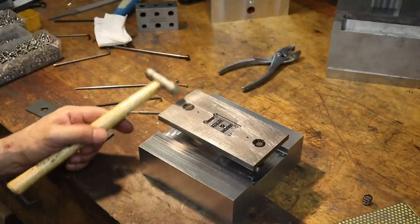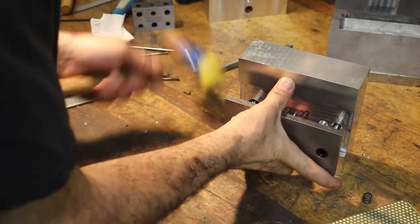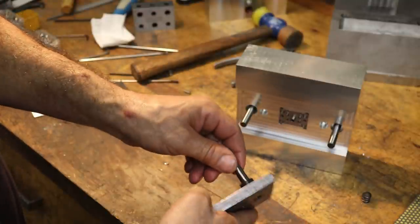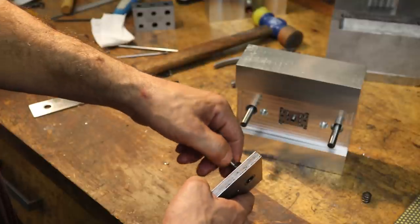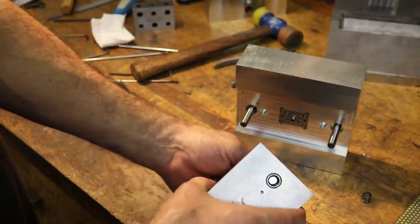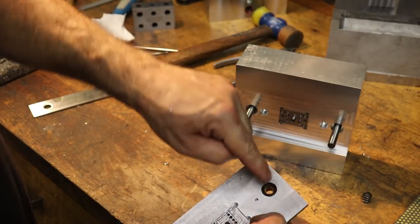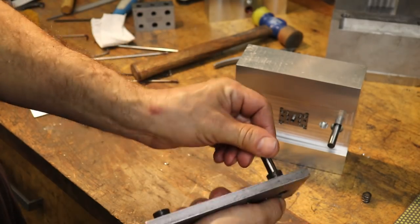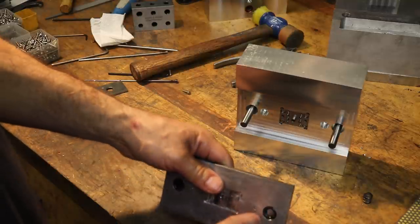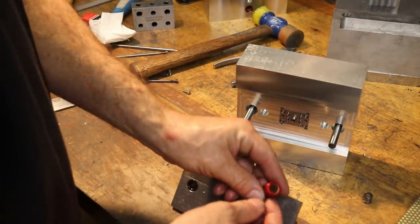You know what, I think I may have pressed these guys into the steel too hard and the bearing itself is constricted in diameter. All right, I just about got this plate back off of here. I have a scrap piece of 3/8 dowel rod here, precision, and it doesn't have any problem sliding into the sleeve bearing back here where it's not pressed into the steel. But as soon as it gets into the steel part, where it's constricted, it stops. So on this side, I probably can't even start it very well. I basically have shrunk down this entire aluminum ring such that we can't even get the rod in. So there's no way I'm gonna get two of them in. And if I replace these bearings with the lined bearings, with the Rulon or Teflon lined bearings like this one here, I think the same thing's gonna happen.